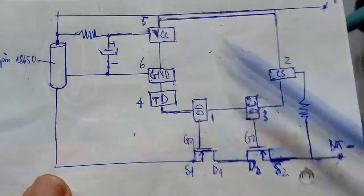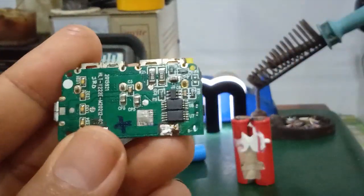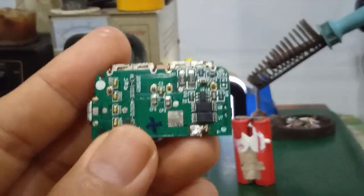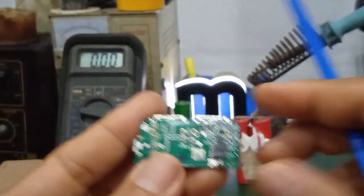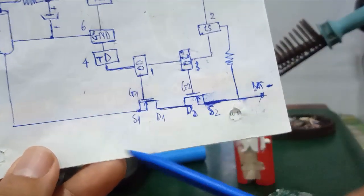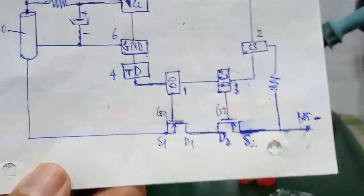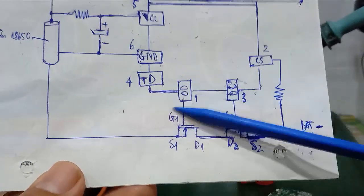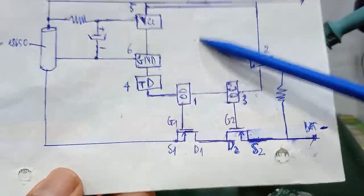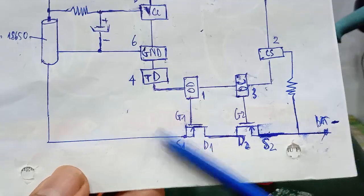If the circuit doesn't cut off charging, the voltage would keep filling up and damage the battery's quality and lifespan. Excessive charging current also causes overheating. This circuit is the combination of the DW01 and 8205A ICs. In this board, there are two 8205A ICs connected in parallel — adding an extra current path. The op-amps inside the DW01 control the Gate to switch the two MOSFETs for charging and discharging.